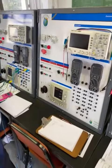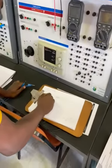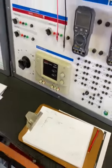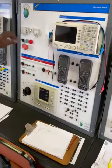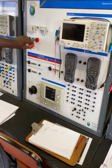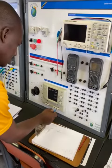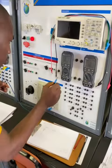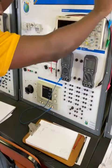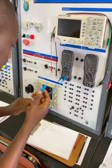In this case we want to get our total current. To measure the total current, what we do is replace our ammeter just after the supply. We switch on the mains supply link as usual. Then we start connecting — we take our positive probe, which goes to the positive of the ammeter, and from the negative of the ammeter it goes to the positive of R1.